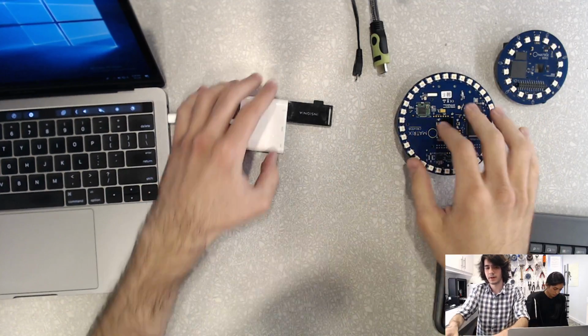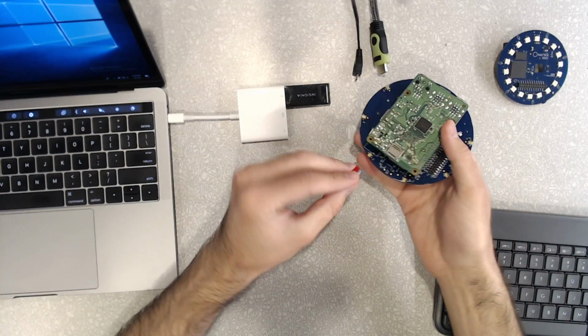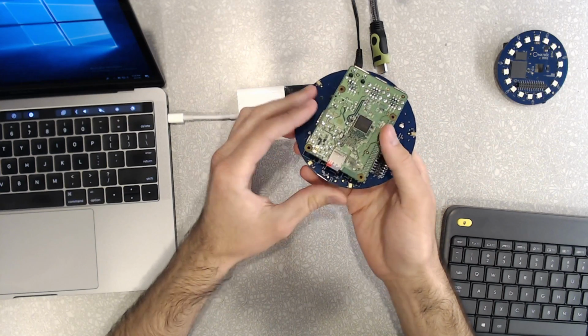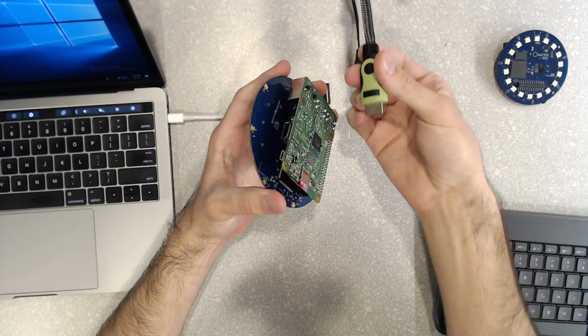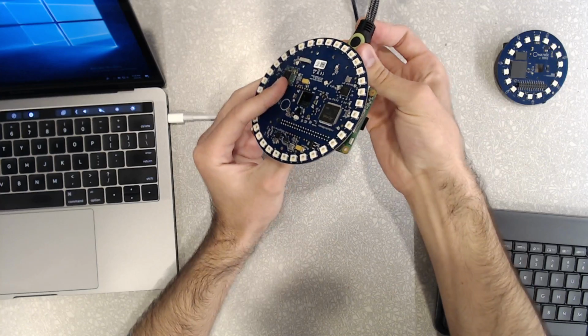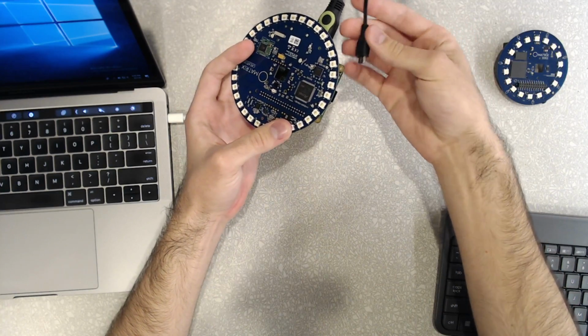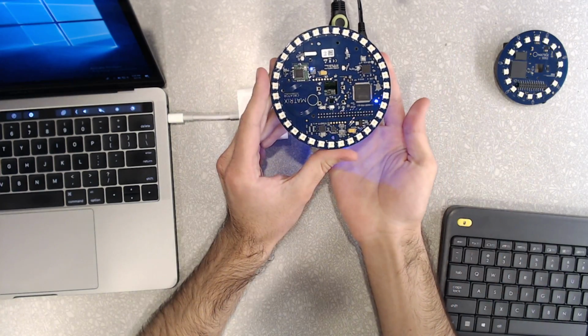So right here, once it's done flashing, just eject. And then what you're going to want to do is get your Raspberry Pi and insert the micro SD card with Raspbian Stretch now flashed on it. You're also going to want to attach the monitor to your Raspberry Pi before turning it on, just to ensure that the screen is rendered properly. And then you can insert the power supply, and your Raspberry Pi is on.